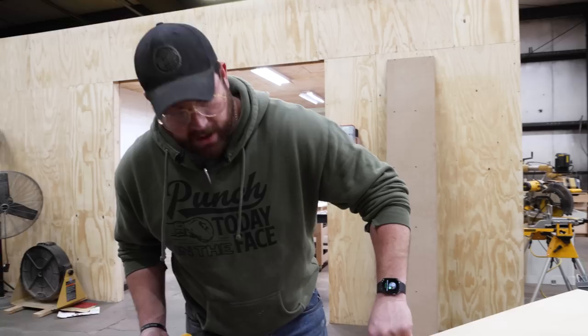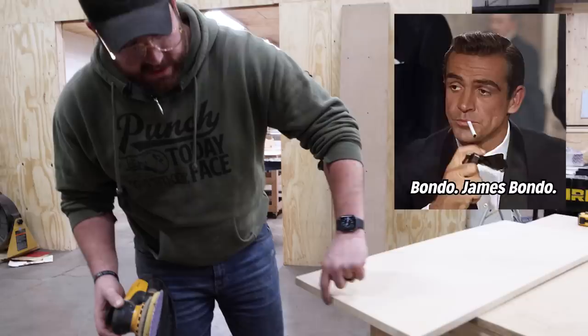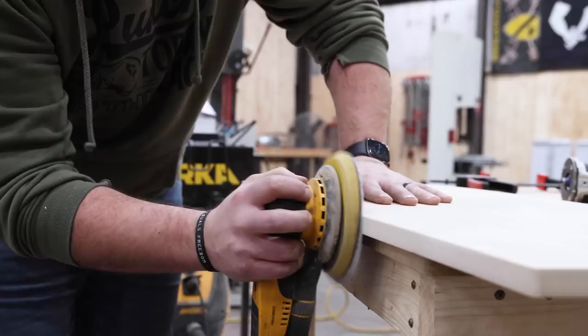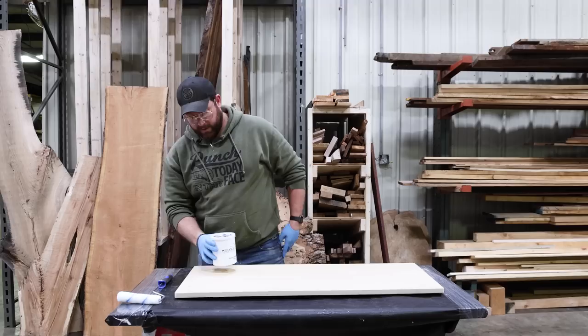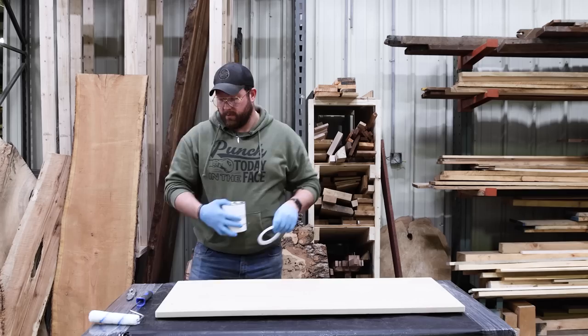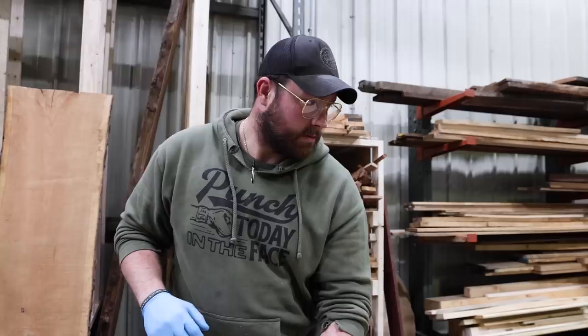The next thing they suggest is if you've got an edge of plywood or something like that you can Bondo it, but you want to sand out any saw marks. So we've got 220 grit on here. The next phase is what's called a base coat. They supply an undercoat — this one's white because we're going with a white Carrara kind of vibe on this. I'm truly curious to see how this goes because it's a different level of resin work that we typically don't do. I'm gonna get this thing stirred up and then rolled on.